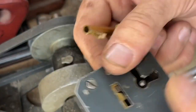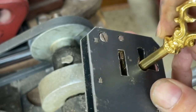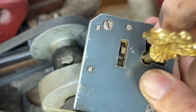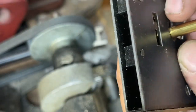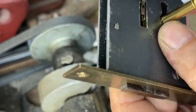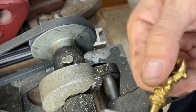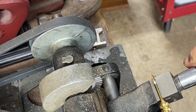Check it, should start coming out even further, and then as we finish it with hand files, it'll be probably good to go. One's a little high, two's starting to poke its little head up there. Honestly, three as well, so we could go a little bit deeper across the board because we have plenty of room up here depending on how tight these upper to lower is right from here. So we have this much room up here, but it's still pressing those levers into the bolt on one and three, which probably would clear up again with hand files. We're just gonna keep on that.